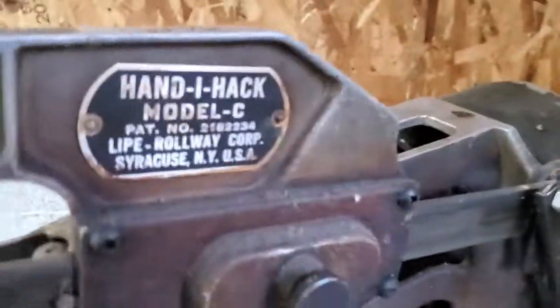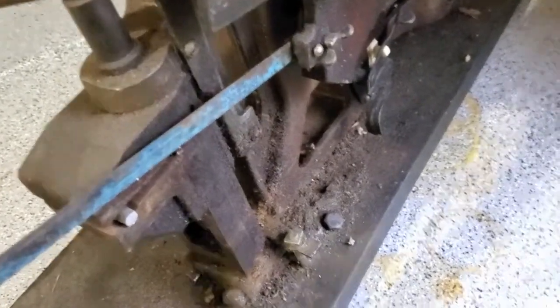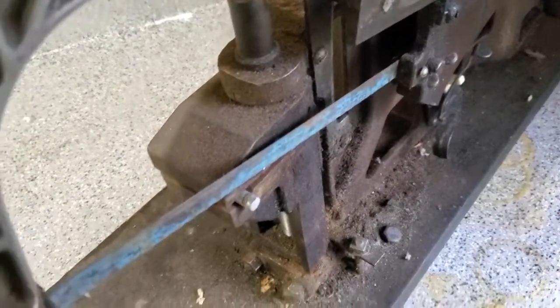Back and forth on the slide arm here - you can see it now moves nice and freely. I got this mostly cleaned out; it's still pretty hideous in there but I refilled it with some oil and scraped off a lot of the old oil. I've still got to clean some more, but now the motor spins freely and as you can see it pulls that down and begins the cut. That oil was nasty - it took a couple of months to get it to ooze out of there and clean it up, and then I just put some motor oil in.